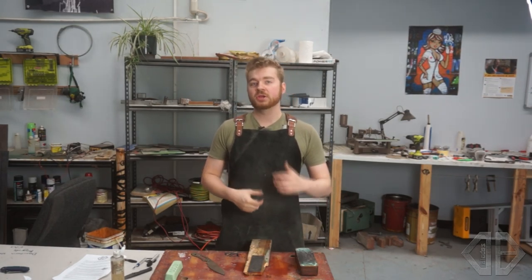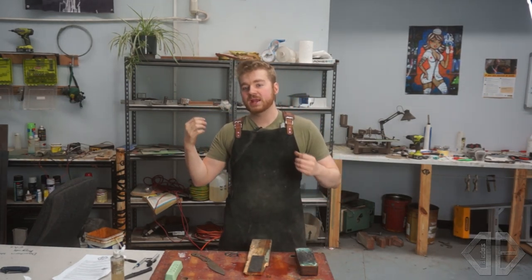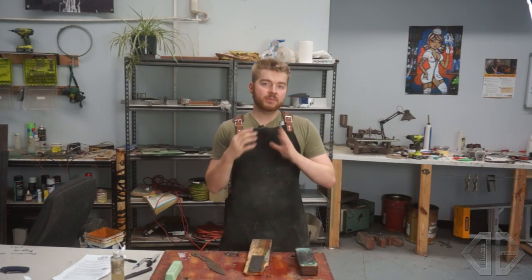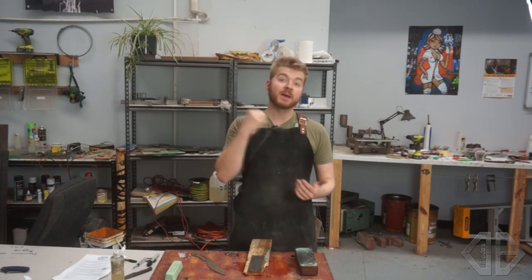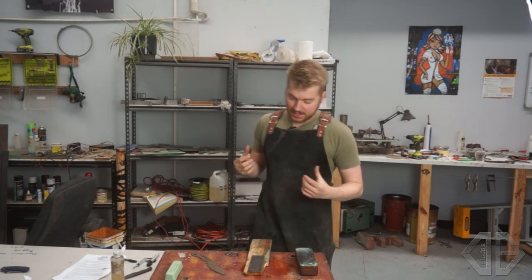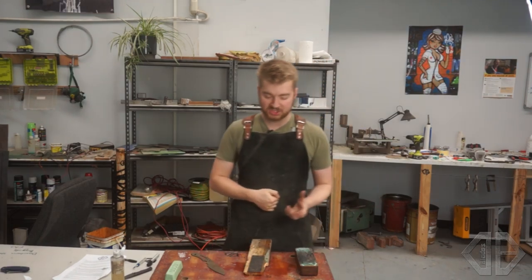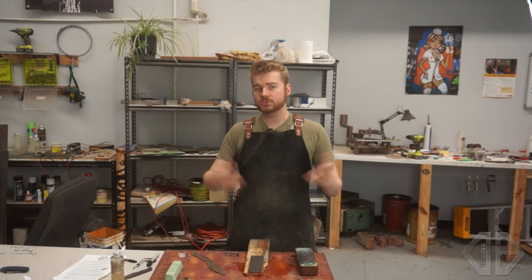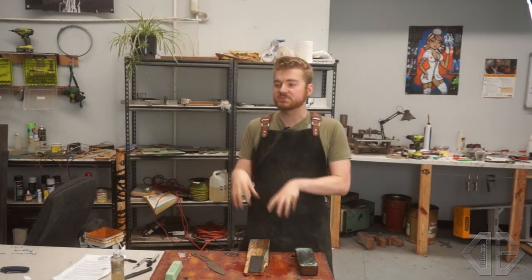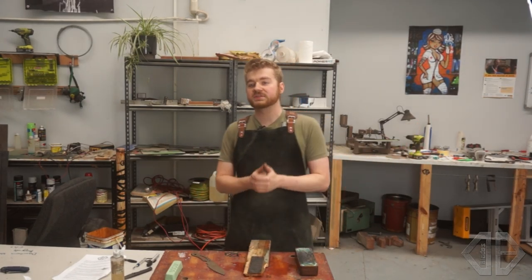So a guy came around today — he was new to knife collecting. He went out and bought himself some ZTs, some Spydercos, all that sort of stuff. Then he needed to sharpen them, so he went to YouTube, Facebook groups, watching tutorials. The thing about those tutorials is these guys sell sharpening stones, so they try to sell you the most expensive stones and the most stones possible. He walked away with hundreds of dollars worth of sharpening gear, came to me wondering why he wasn't getting good edges. I sat down with him, ran through the sharpening, and we just used this 400 grit stone — and he had a shaving sharp edge at the end. He was a little upset, like, 'Why did I spend all this money on high grit stones when I just need a 400 grit?'